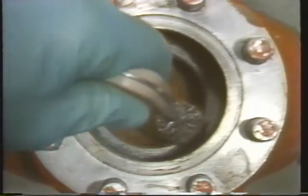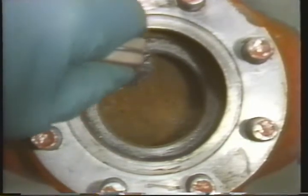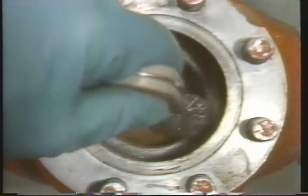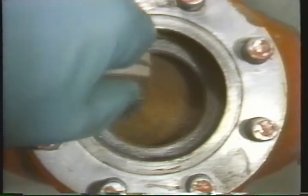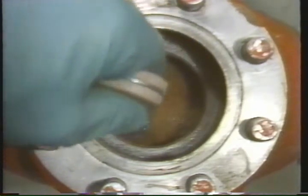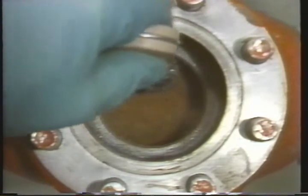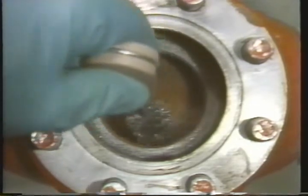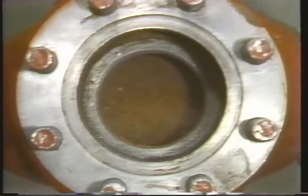The next area to be cleaned is the seat ring area. When the valve is assembled, it is important to have a good seal around the seat ring. Cleaning is a good practice to prevent any interference with the seal. We've started with a wire brush to remove hard remnants of sealing compound, rust, or any other foreign matter. Care will be taken to clean the shoulder inside the valve body where the seat ring rests, so we'll have a clean surface when we apply sealing compound here later. Also, it's important to clean the threaded areas in the valve body so the new seat ring will thread properly.